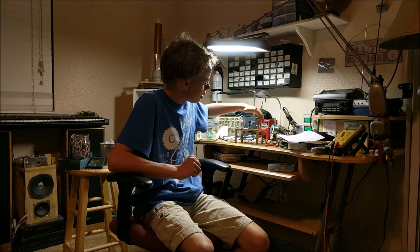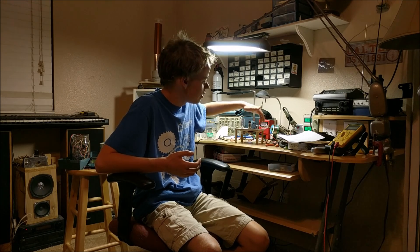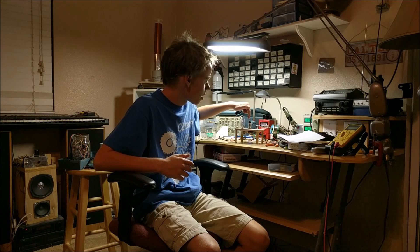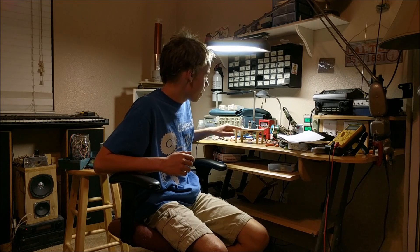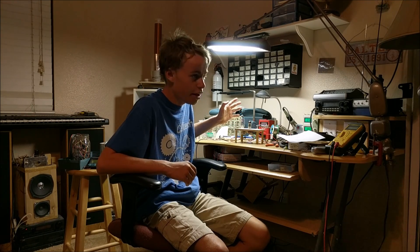The way I've done it is I've used this neon light bulb, and this neon light bulb is in a relaxation oscillator circuit. What happens is this neon light bulb sends a pulsing little pulse over a wire, and that goes to the grid of this vacuum tube, which controls the current flow from the plate to the cathode. That, in turn, controls the relays turning on and off, which activates the incandescent light bulb.